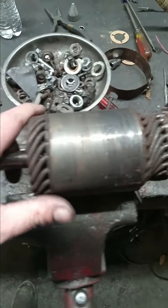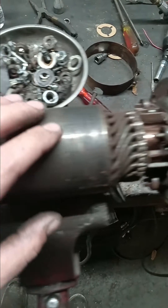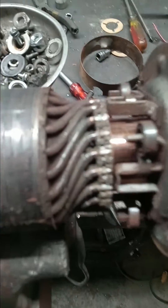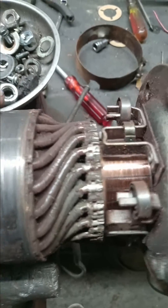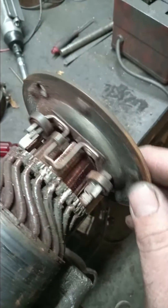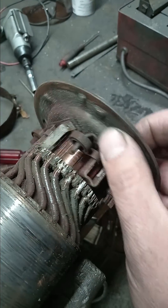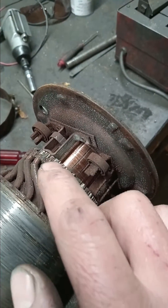We're back here on the antique Ford tractor starter that has a sling-out drive on it. We've torn it open and found that the lead is slung out of the armature. If you look at the top of the cap you can see like a frosting right in there — that is the lead that has come out of here, and here, and here.